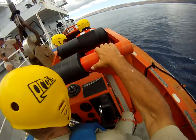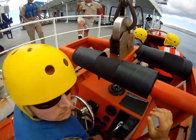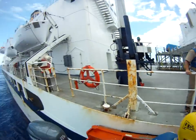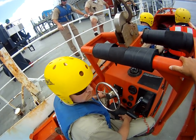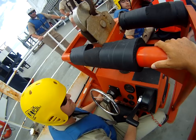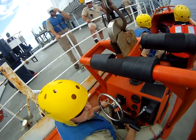We're gonna whip down. When we get down to the bootstripe I'm gonna say 'arm your hook' — you squeeze that handle, you pull it to you. Then I'm gonna call top down, that'll bring us away from the ship. When we hit the water you start the engine, and this hook will release right away. I'm just getting out of the way of the hook.